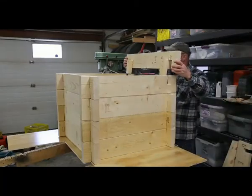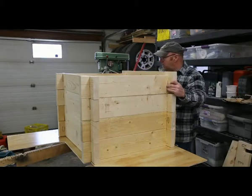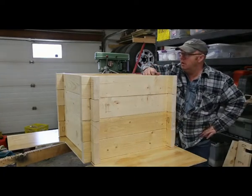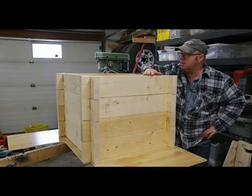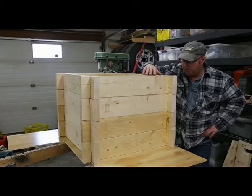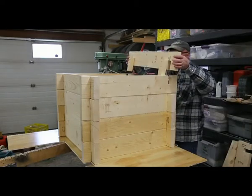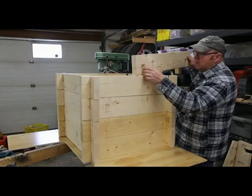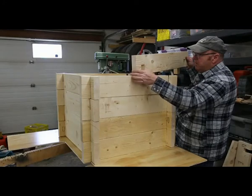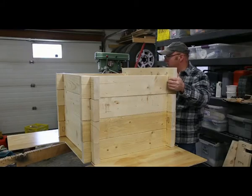Steve here. Today, we're going to build this potato box. A simple little project. All you're going to need is 5 2x6s, a couple screws, some tools, and the project is actually quite simple. Basically, construction is just a couple of notches here. So these are just kind of half lap notches and a couple cleats. Basically it fits together like this.